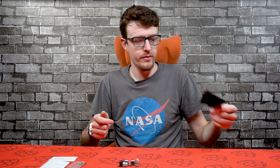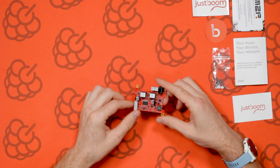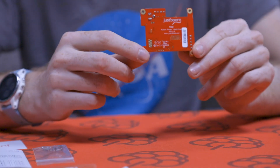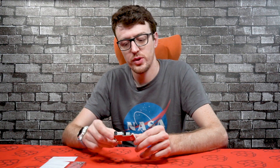Here is the board — you've got the JusBoom logo at the top and 'amp' on the bottom. You can see it's quite a busy board and a bit of a funny shape, and there's a reason for that which is to do with stacking on the DAC hat or the standalone DAC. It's got nothing on the back, and again that's to do with stackability — it sits about two millimeters above the DAC boards, so keeping the back completely clean avoids any possibility of short circuits.